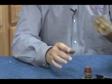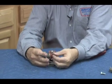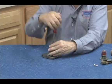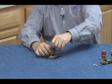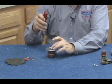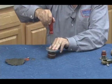But let's talk about the relief valve, and I'll go ahead and show a 2-inch just because it's a little bit bigger and easier to see. Now, on the 3/4 inch, the one thing you'll see is that mounting O-ring that holds it into the body. We'll talk about that when we put it back together. Let's go ahead and remove our relief valve disc first. There are 2 screws. This screw holds the disc retainer and the RV disc. Turn it over. I have a second screw, and this will have my relief valve spring tension on the back side. So as I go to remove it, there will be spring tension coming up.